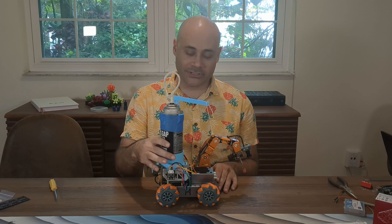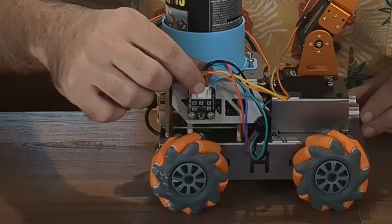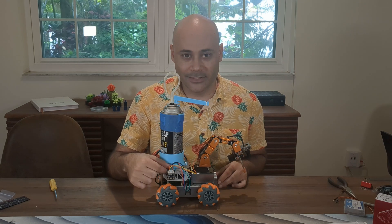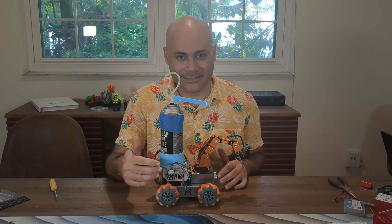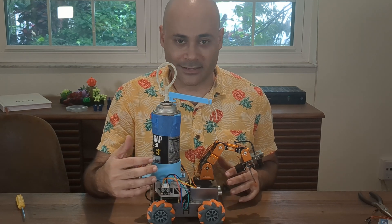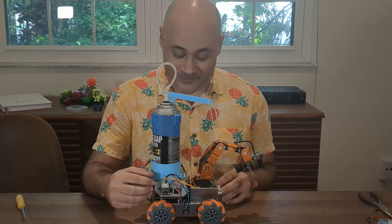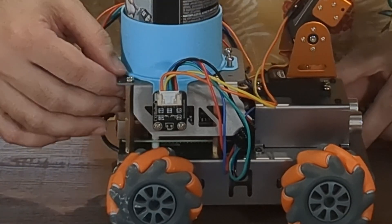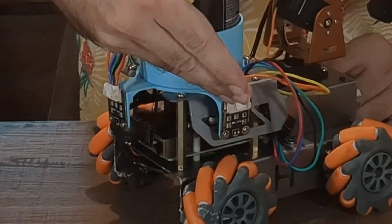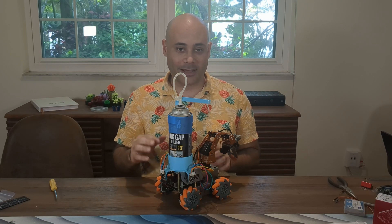We're definitely going to activate the sensors. On most of the video you saw, the sensors weren't mounted, and that's because once I did finally mount them, I could only get one sensor to activate at a time — it has something to do with the registries for the sensors interfering with each other. I still haven't figured that one out, so that'll be some future video. I made these extra brackets so that the sensor can be mounted here for measurement in one direction and here for measurement in the other direction, and that'll allow us to locate ourselves inside the box we made.